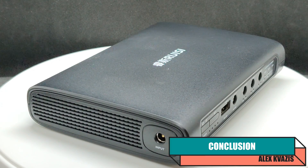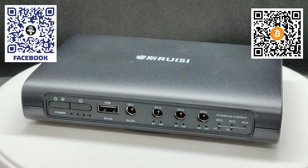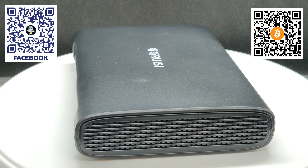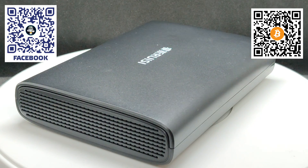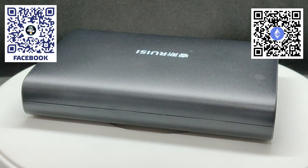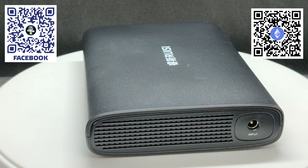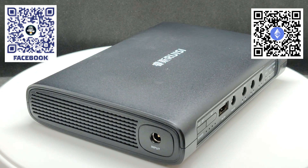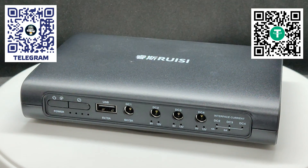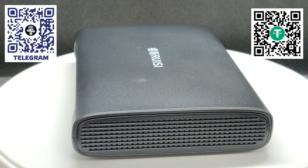Let's sum up. The advantages of this device include: a good number of output ports, flexible voltage settings on three of them, current aggregation which is useful for heavy loads, decent capacity compared to similar devices, good circuitry with effective protection, a powerful power supply and reliable bypass function, immediate port activation after power restoration, and acceptable full charging time. What I didn't like: the claimed capacity is overstated — the actual is slightly over 20,000 mAh. The power output also falls short of claimed levels, though the aggregation feature still makes it higher than most competitors. Also note a common mistake: users calculate power consumption based on power supply specs — if it says 12 volts and 3 amps they assume 36 watts, but those are the maximum the supply can deliver. Actual consumption needs to be measured and will likely be much lower; knowing this and the UPS capacity will help you estimate run time.